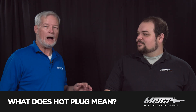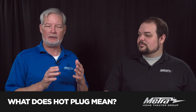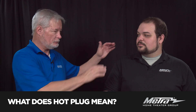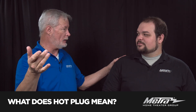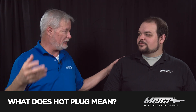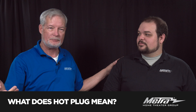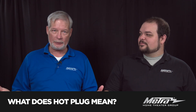Let's talk about what hot plug is, because this is very, very important to HDMI. HDMI is a strange duck in the way that it works. The source — let's say Adam is the source — will send five volts out, kind of a doorbell, ding dong, to the display or the next device in line: AVR, matrix, display, whatever's next. That device will send back its own 'hey, how you doing?' — this is hot plug.